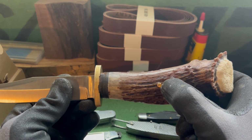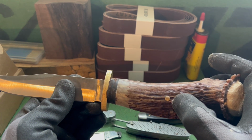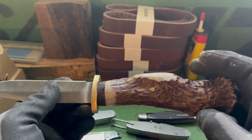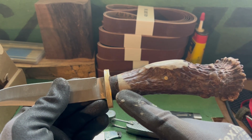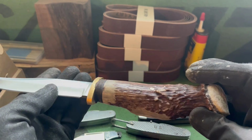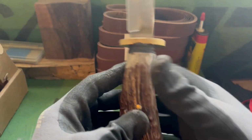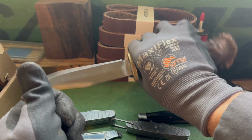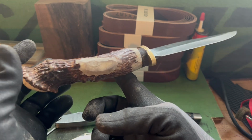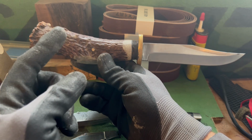And so you can see that the tang actually goes down to about there, but the tang did have, I don't remember the size, an opening for a pin. So I filled it with epoxy after I drilled it out, and I measured more than a few times to make sure this lined up, so that I only drilled it one time. As you can see, this had a tine that was coming out. But yeah, came out okay. I realized that the handle is way too long. Like, look at the balancing. The balance is like back here. But I didn't want to chop up the handle.